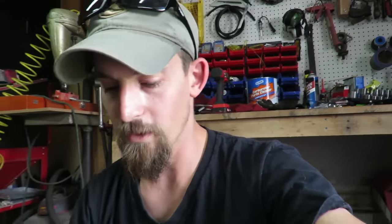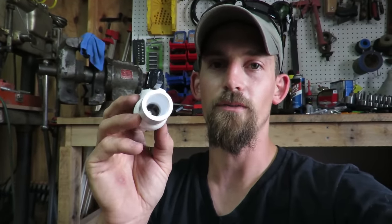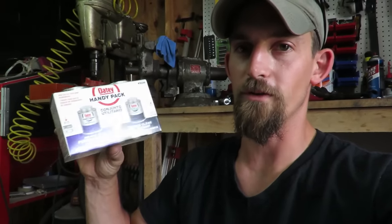If you guys are up north, you're going to want some kind of extra precautions about draining your line. At the lowest point of my house I'm putting in a T, and on the T I'll have a short piece of PVC pipe and then a ball valve so I can drain out my line whenever I'm done with it. Whether it's every day or a few times a month, I can drain it so there's no residual water sitting in there. And to connect everything together I've got this handy pack of cement and primer — prime first, cement after.